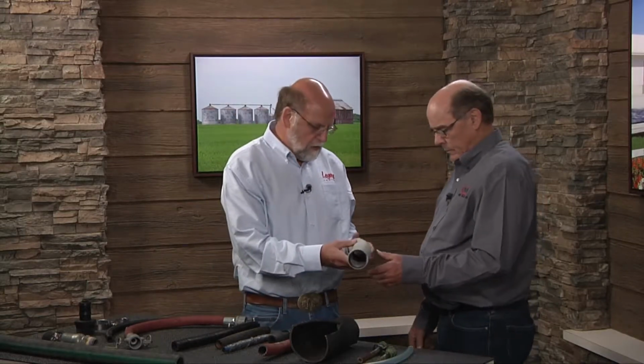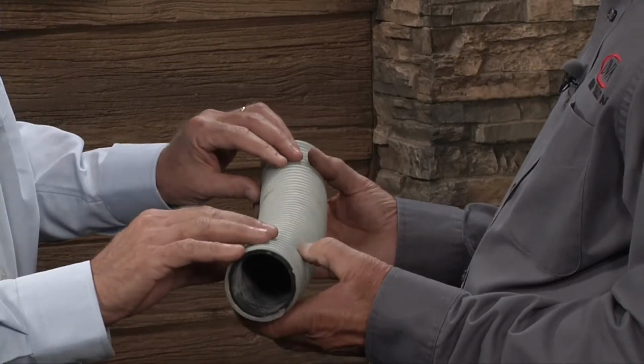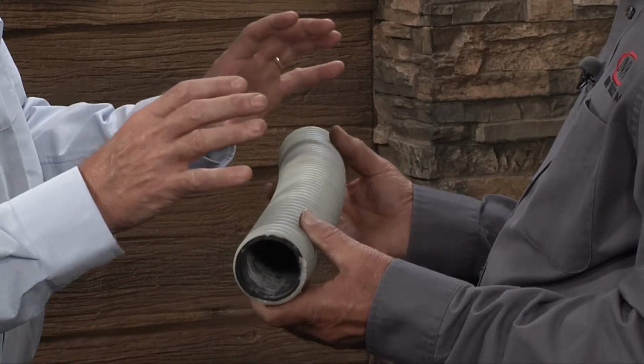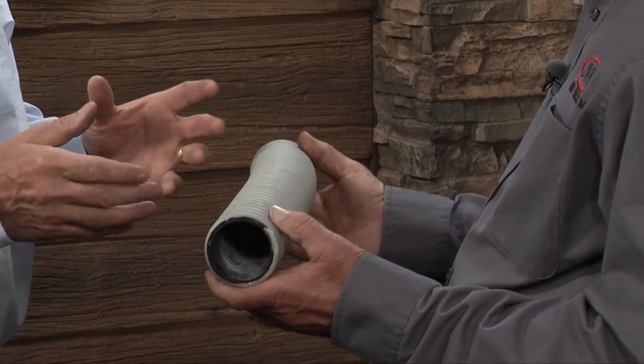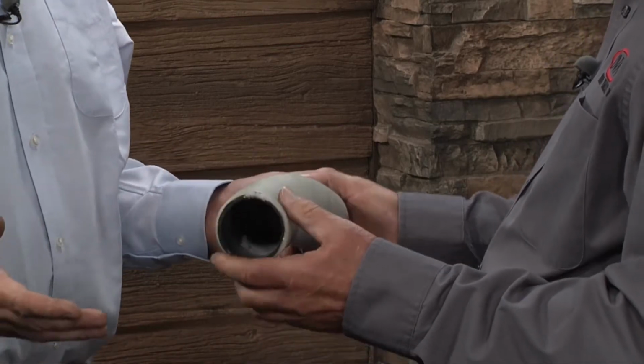You bet. So I thought we would get some of your experience, and you could teach us a little bit about inspection, some techniques and things we should pay attention to. I thought we would start off with this particular hose here. This is a suction hose meant to go between the tank and the pump. It's reinforced because when the pump is drawing, it's creating a vacuum. But what can go wrong with these hoses?